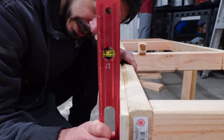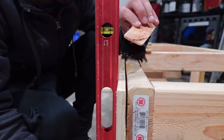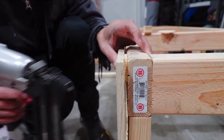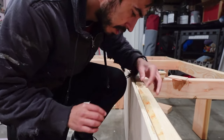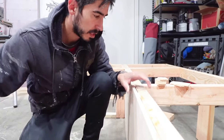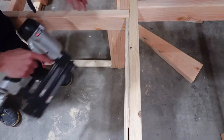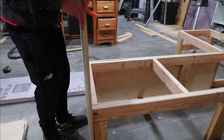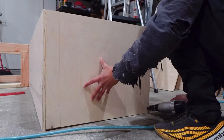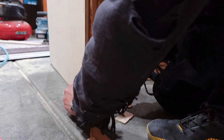When I pressed it up, we were out of plumb by a pretty big amount, so I made some little spacers. The process is pretty much the same for the other sections of the bench — just getting the plywood on, scribing it out, checking it for plumb, and attaching it with some brads.